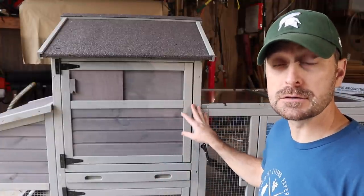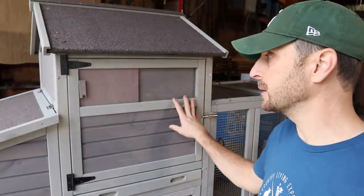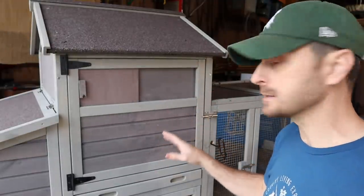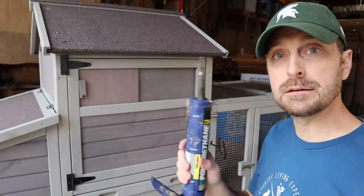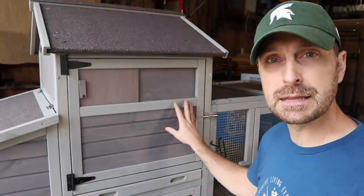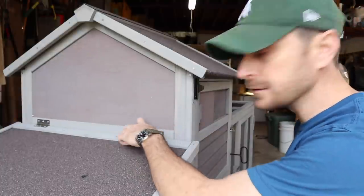The fit and finish is nice — all parts and pieces go together flawlessly, all screw holes are aligned, everything slides and works well, and it's square. Now let's talk about materiality. This seems to be some sort of white pine or yellow pine, and it's fairly light. It looks really beautiful the way they put these joints together, but unfortunately it's not going to take a lot of rain or weather for very long before it starts to rot out. I'm going to need to go around and meticulously add caulking into all these joints to seal them up and make it weatherproof. Additionally, this may be just a light primer on here, and it's going to have to be painted if it's going to remain outside in the elements.